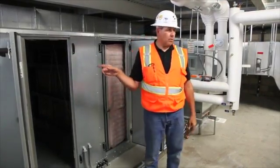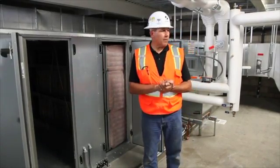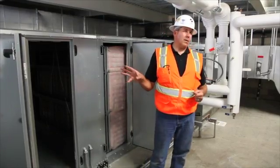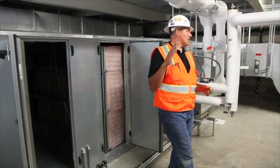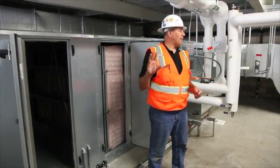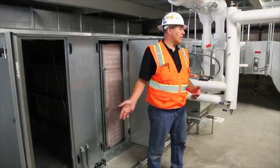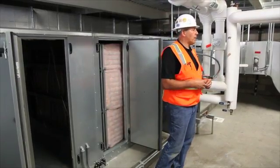It looks like all sleeve bearings — they're horizontal, so there's no true maintenance on the sleeves. We used to put graphite on things like that but we can't use it anymore; for the most part they're somewhat maintenance-free. What commonly happens on outside air dampers is they'll want to freeze up, sitting at that minimum outside air condition most of the time. No one maintains and looks after them, so your efficiency goes away because you have free cooling and they're sitting locked in one position. They're very important to maintain — make certain they will stroke all the way open and closed.